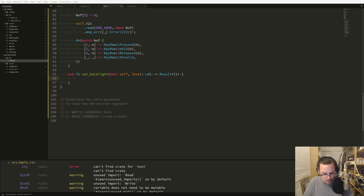Well, this also means you would not have universal drivers which just work on the nRF52. Yeah, you're right. Like I said, I'm going to go ahead and implement that patch in the nRF52 HAL, because we should be doing that for the embedded HAL. We went back and forth on it and decided not to do it when you're calling the nRF52's own ones, but generally for the embedded HAL ones we'll swallow some overhead so that drivers work.